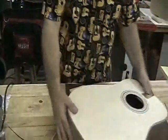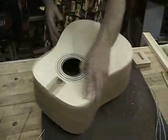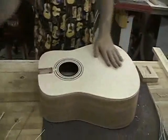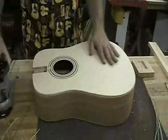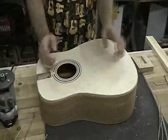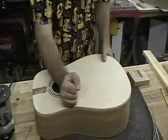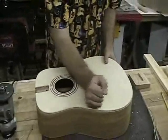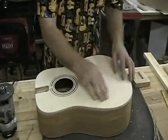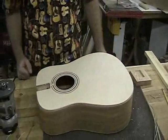The other thing to bear in mind is that purfling only goes on the top. So we're going to make the same cut, same technique, from high to low. You'll notice when I was doing the binding, I'd come all the way to the bottom and then re-track it all the way around — that makes a second cut and really gets a nice clean cut on the second pass-through.